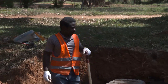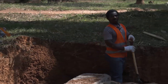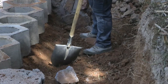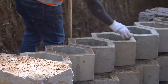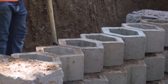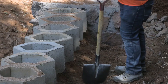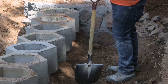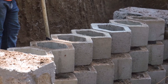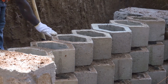So the next step is to backfill. As we backfilled each course, we finish the course, then we backfill. Now we are going to backfill generally until we reach this level. You may continue to go up according to the height of your slope. If you reach the height of the slope, you stop and compact all the soil that you have backfilled. So we backfill, we compact, backfill, we compact, until we reach our top level.